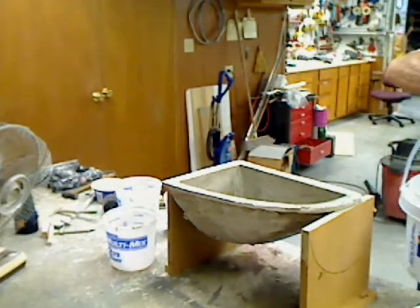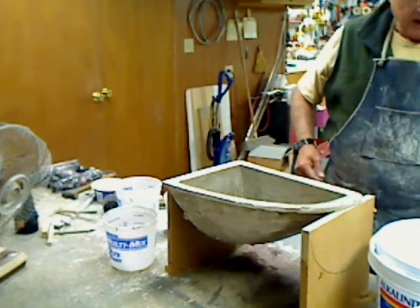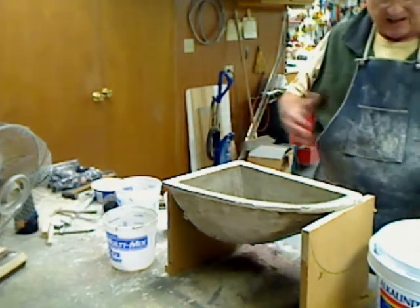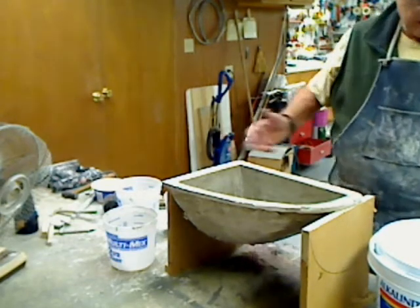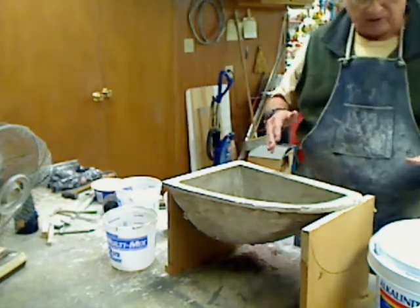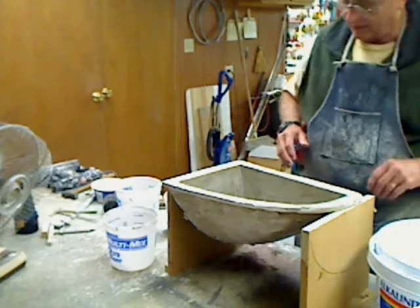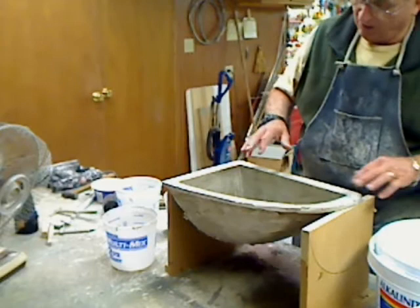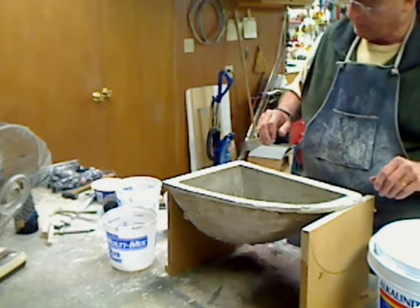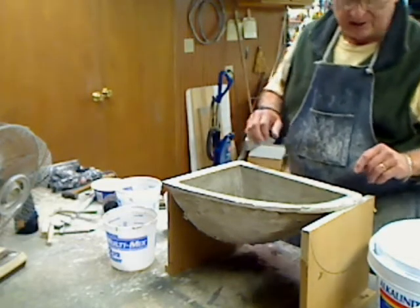We'll take this — I'm going to pour this two quarts of water in there, just a little bit extra, and then I'll mark with a piece of masking tape inside at the level I want to get to. That way, when I mix it up, I can pour my water in my Ultracal, get it mixed up, and keep it mixed up until it gets up to the liner so I know I've got enough material to fill this up. Then we will pour it in, slap in the Styrofoam mold, and see if it overflows. Hopefully it doesn't, but hopefully we've got enough. You're more concerned about not having enough than having too much. So I'll get this dried out and measured up, and we'll be ready to mix up and pour the plug.